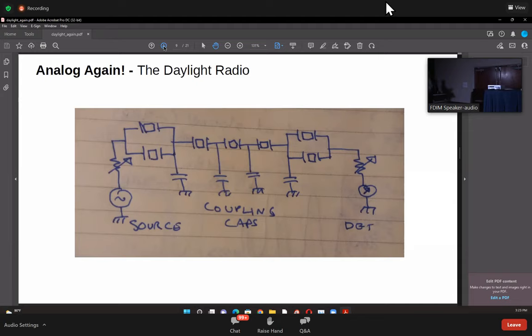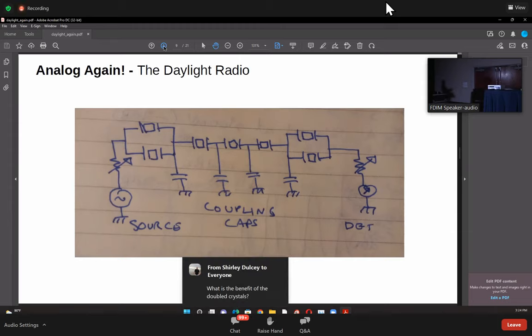The end quartz crystals are doubled up, the two of them paralleled up. Now, the coupling capacitors will determine the bandwidth of the filter, but there is going to be ripple inside it. You control the ripple by controlling these two terminating resistors, okay? So you can put a 2K pot on both sides, try tuning it, and scan it with your nanoVNA or your Antuino, whatever you have, to get the bandwidth right.